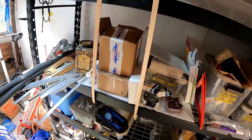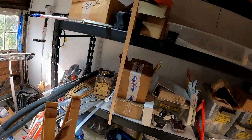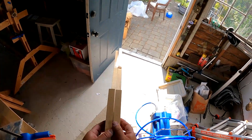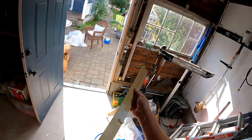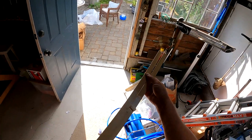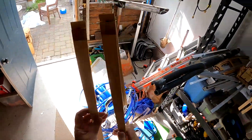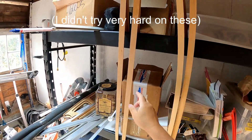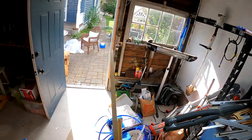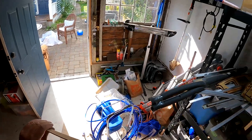Big surprise - I've got two complete sets of them. Notice how twisted this one is right here - three of the four were twisted really badly when I got them out of the box. One of these was fine, and the other one was the worst one I had. So I just threw them in a tub of water for a while on a nice warm day, left them in there for about 10 minutes, took them out, flexed them around a little bit and restrained them, and they actually were a perfect match set. So if this happens to you, it's not a tragedy - you don't need to get new ones. You can just soak them in room temperature water; at that point they're pretty flexible.